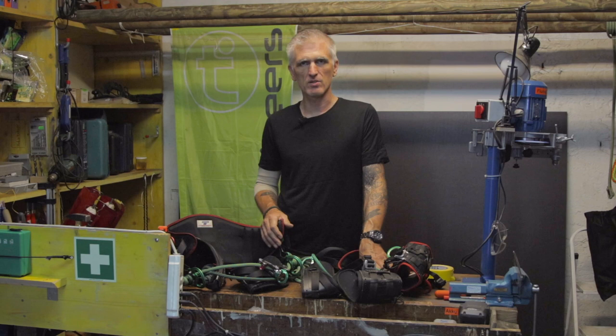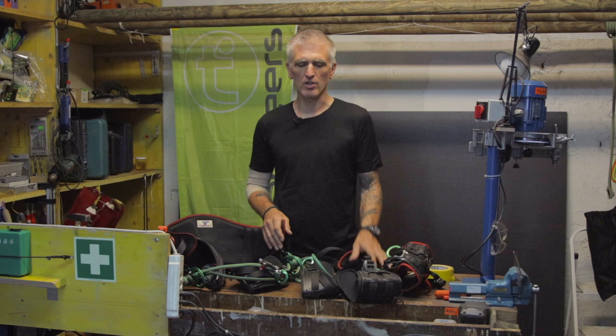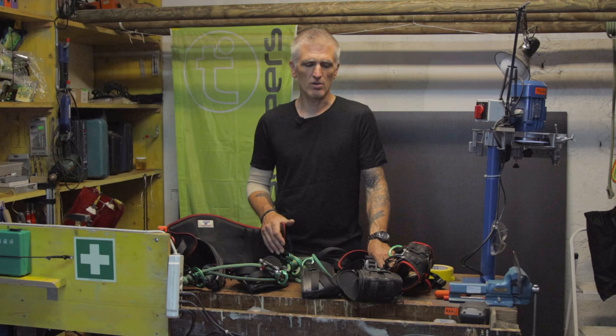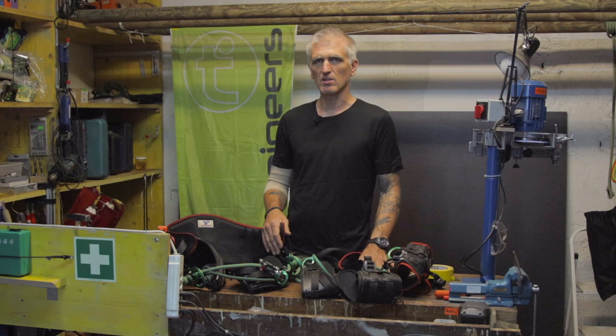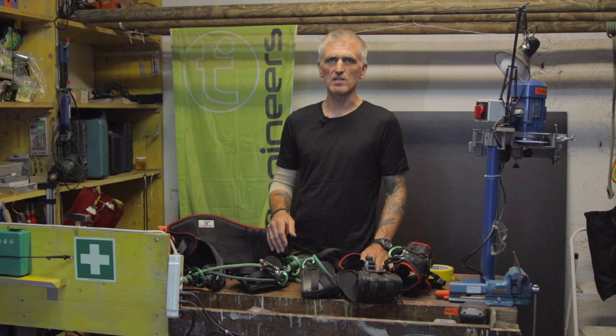If you have any other questions regarding this, we'll post a number of links below this video that will point you towards manufacturer information where Teufelberger have further specified maintenance and replacement of rope bridges. Or obviously if you have specific questions, Teufelberger, the manufacturer, is the correct partner to get in touch with. I would also suggest that during your daily work you do partner checks — check each other's rope bridges and regularly check your own, because it's just such an easy thing to do. Visual inspection, tactile inspection, probably good to go. If there are things that are unclear, clarify them. If it needs replacing, replace it — don't wait too long, because your life is literally on that line.